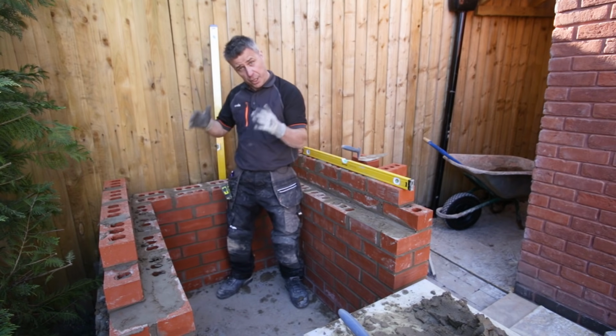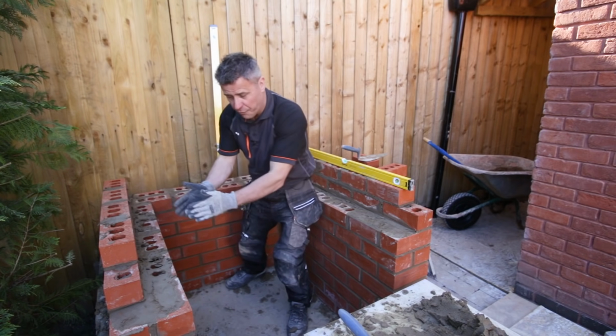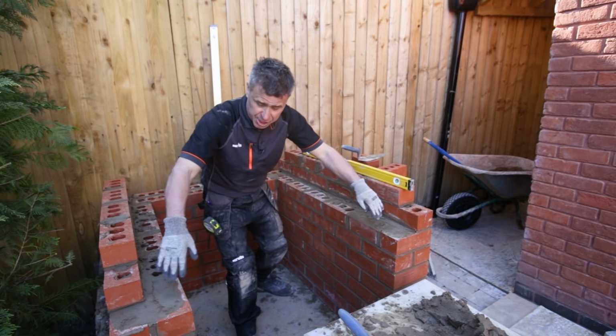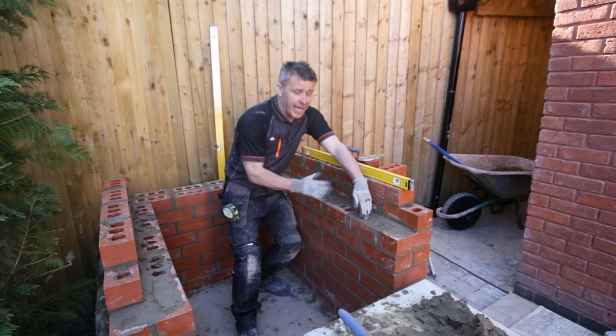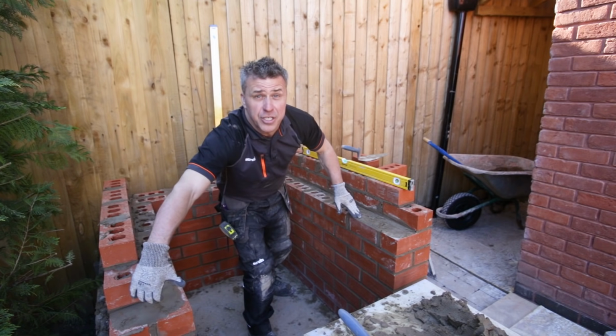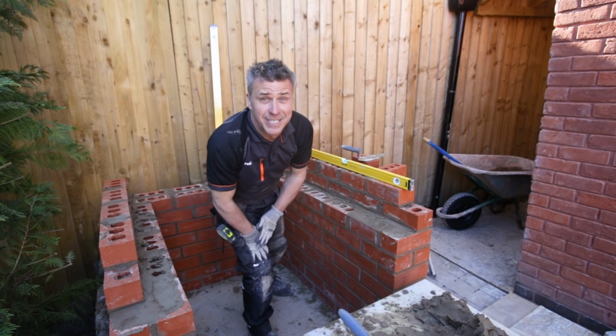And then my lintels, they're concrete precast ones. They're going to sit on here and they're actually going to come forward. So what I need to do next is cut a couple of pieces of steel which will sit on here, take the lintels sitting into place there, and then also the front steel will hold the facing brick that bridges across the front there to give you that storage space below your pizza oven.